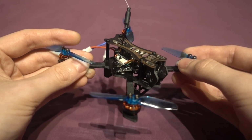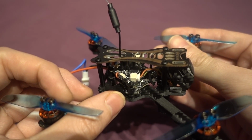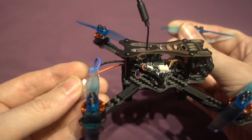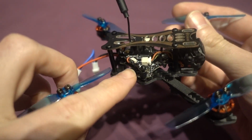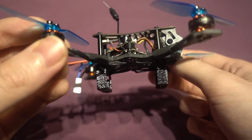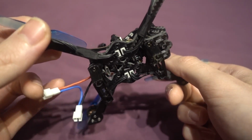Anyways, I digress. As I've already mentioned, the flight controller is a copy of the Happy Model Crazy Bee V1 board, so just like the Novice 1, adding an XT30 is a risk because it unleashes more current to the inferior built-in regulator and underrated ESCs that the Crazy Bee V1 boards suffered when people experimented adding an XT30 connector.